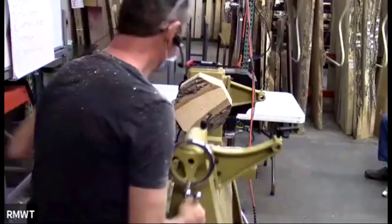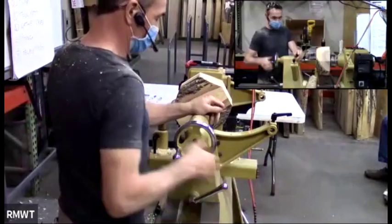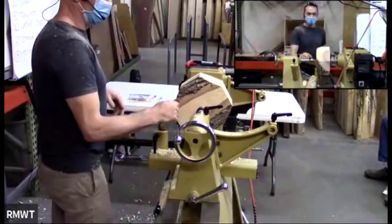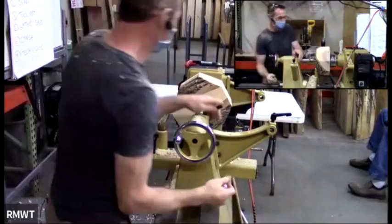Normally, as you know, guys, not our favorite type of drive center for woodturning in general. It's just too pointy. One with a ring center on is much better for us, because what you can end up doing here is, you bury this in here and then you finish the bowl a few months later after it's dried and you're trying to turn this little black dot out and you keep trying to get rid of it and get rid of it. It's because the mark is left, and then boom, you go through the bottom of the bowl.